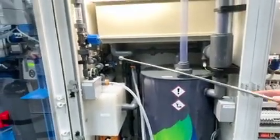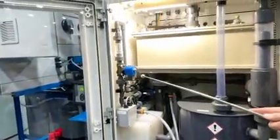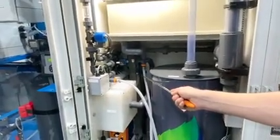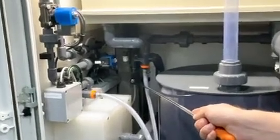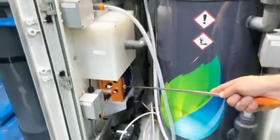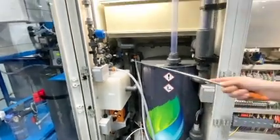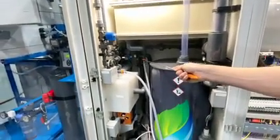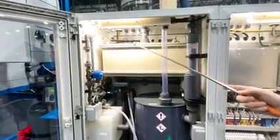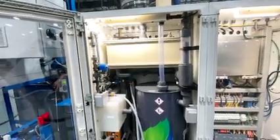Now we go back to our water supply system. So we run water through the valve, flow regulator, the flow meter, and now over here it is meeting the brine injection. So in this injection valve, brine is being injected by this dosing pump. So the suction line of this dosing pump is connected to the brine tank, and the discharge line of that dosing pump is in this injection valve, where it's injected with the softened water stream going into the first hypocell. So that is the water plus brine entrance into the cell.